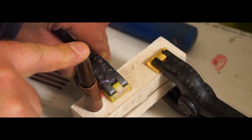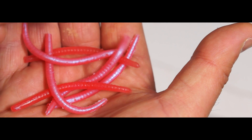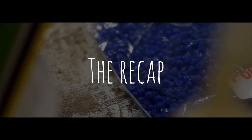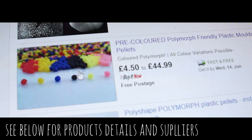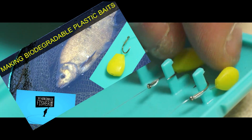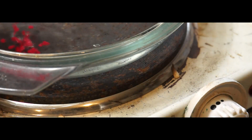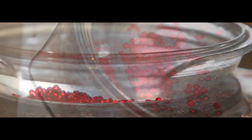The mold will let me inject hot soft plastic to produce small worms and other soft plastic baits. To make the worm master, I used a low-melt plastic called polymorph, which can be bought online for a few pounds or from a hobby shop. If you're a regular to this channel you may have seen me use this to make fake corn fishing baits for catching bream and carp. It normally comes in pellet form and softens in hot water over 60 degrees, turning almost translucent.